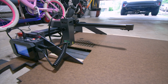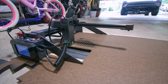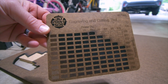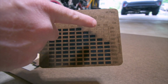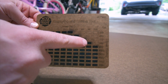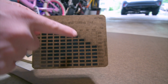So it looks like our testing is complete. File is print done, it says. Alright, we'll hit OK, and now we can freely move this out of the way. This is a perfect example of why we do tests like this with laser engravers. The whole point is it shows you the power going in this direction and the speed going in this direction, faster going down and more powerful going to the right. Right around here is when, typically on these tests, these blocks even tend to catch fire sometimes. Obviously not all the way to burn, but they do have a lot of soot in this direction.